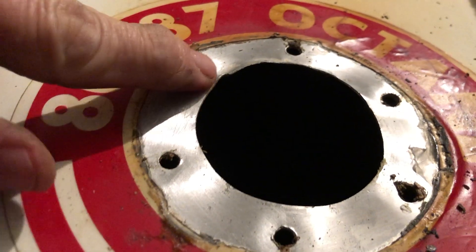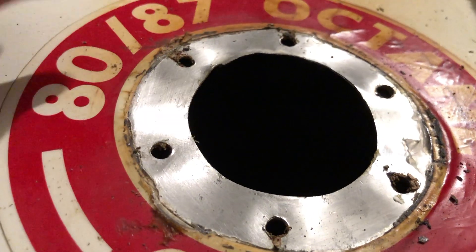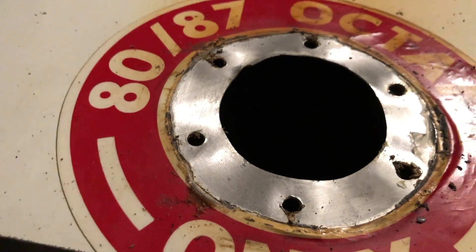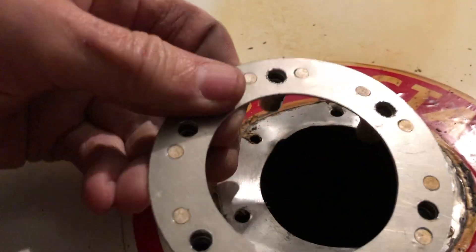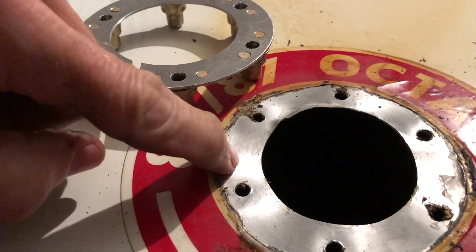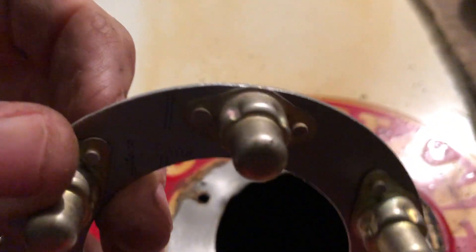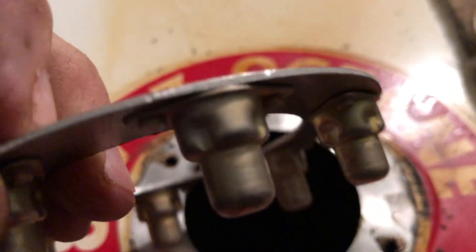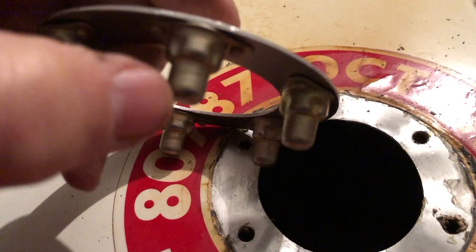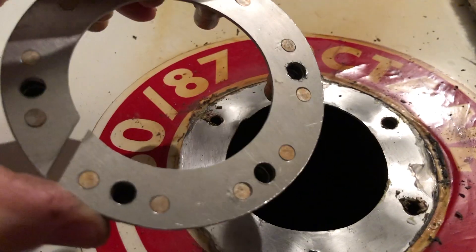See how this metal on the fuel tank is flimsy — it's just not great. The idea is taking this backing plate and getting it underneath here with a seal on top of it and a seal on top of that. These encapsulated nuts are sealed and will prevent fuel from leaking up through the threads. I think that's where a lot of my problem was.